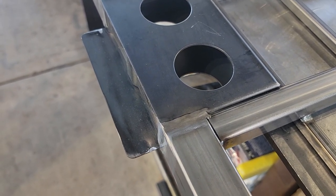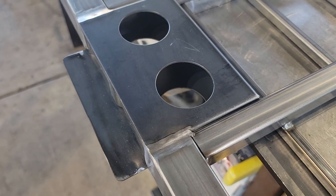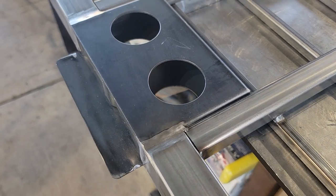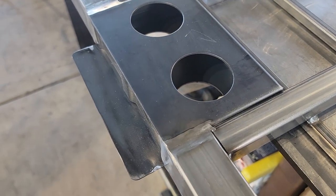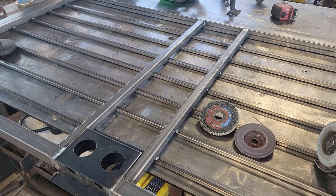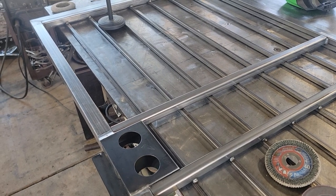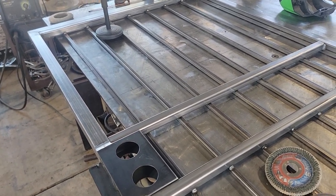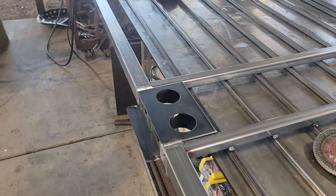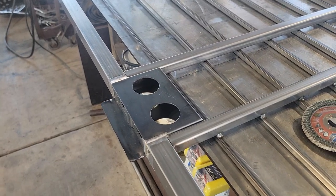Over the years I've realized that paint can magnify mistakes, and so I had this idea: wait a minute, why can't I use my Warrior polishing grit just to knock down the hairlines from a 40 grit pad? Even though this is just a very basic courtyard gate, I'm charging $1,500 for this. And for you guys out there that are confident and can do a great job, I've seen people who say they can weld and build stuff, and it looks like crap. They gouge their work with a hard disc, then sandblast and paint it, and it looks terrible.